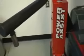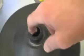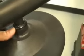Okay, it's time to install the helpers, and the first thing I did was clean off the shaft, because it's pretty dirty. And then we're going to take Super Lube, which is white synthetic grease, FDA approved, safe for plastics, and grease that guy up. And also we grease the insides here, and we want that to roll smooth, and we'll go ahead and install these. Use an 8mm, you can see it's really smooth, and the way that goes on is the big spacer goes here on the top, and then the bolt and the washer goes on the bottom.